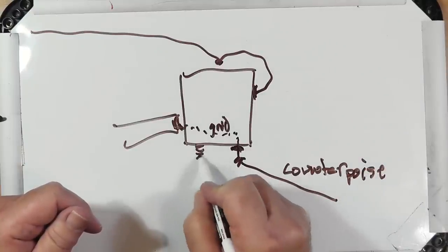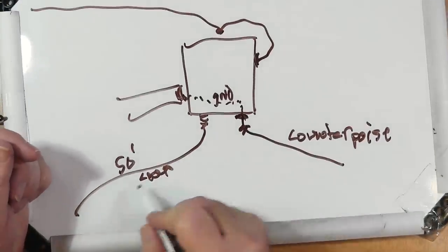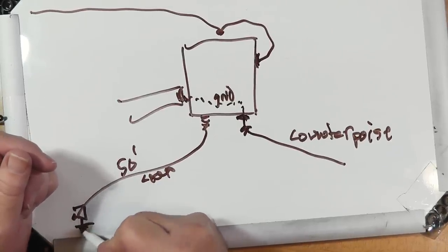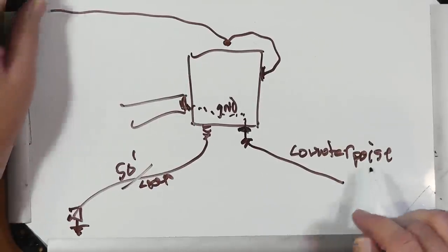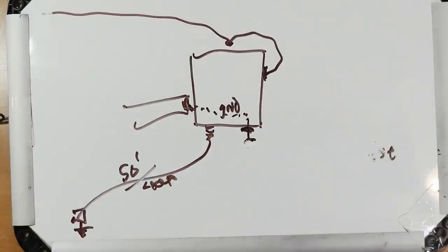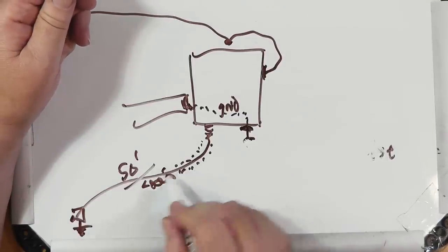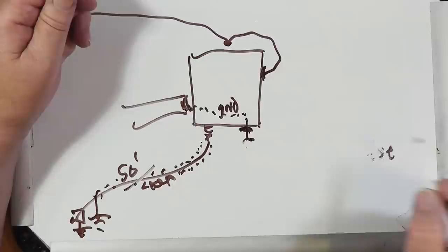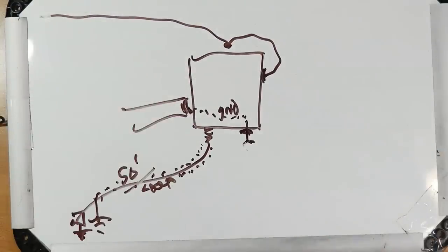In my case, I had a 50-foot piece of coax — that's my standard connector for testing antennas — coming over to a lightning arrestor, which is connected to a ground rod. So the shield on this is connected to ground over there with 50 feet of it. I did not need and did not use a counterpoise because my cable was so long that the shield on the cable acted as the counterpoise. It went down the outside of the shield, but that was grounded right there, so it didn't go any further.